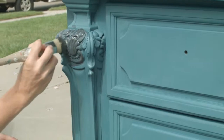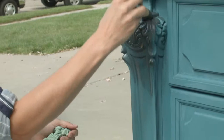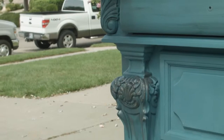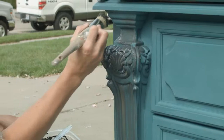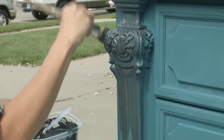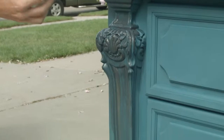The more you do this, the more comfortable you'll be glazing. You can do larger areas, and if you really want a darker effect you can leave it on for longer periods of time. But I recommend when you're starting to start out with a small area and see if you like it. These grooves are pretty hard to wipe off sometimes — it's hard to get it all off.